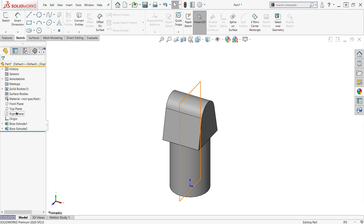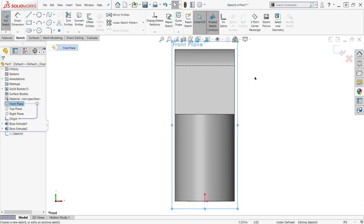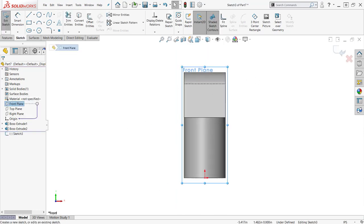All right, throughout this, I should note that I'm using default reference planes whenever possible. I prefer to use them if it's convenient because you can't break them, they don't go away. It just helps keep your model a little more robust when you go to edit it later, so you can't break one thing and have it trickle down and break a bunch of other stuff.